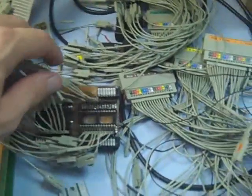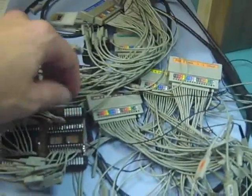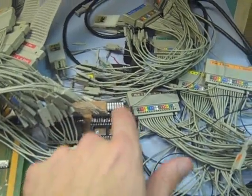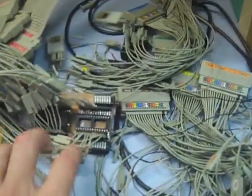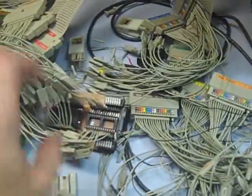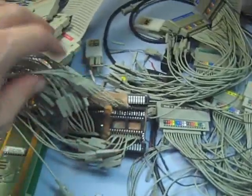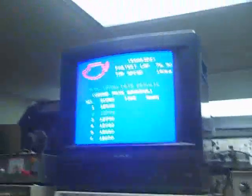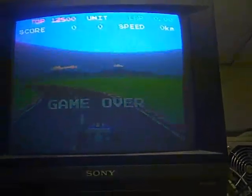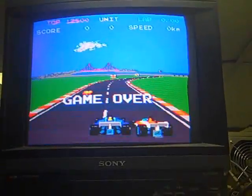This new one I built the other night and actually etched here in the lab. It has DIP switches for every single pin on the custom — about 28 pins — so if I want to tie certain pins together on one socket and another, I can just flip the switches. Now that I'm done with the 4-series I need to move on to the 2-series, and I can reuse this exact daughter card by looking at the 2-series pinout, clicking the right switches, and comparing the outputs. It's just a pain because of all the subtleties — the sprites, the underpasses, the explosions, the signs — but it seems to be working.